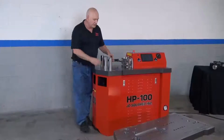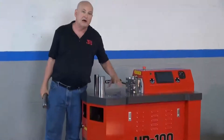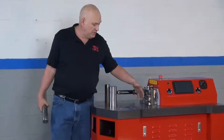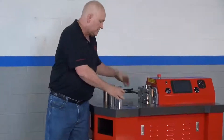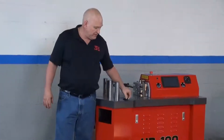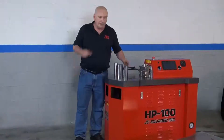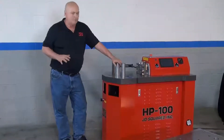If you notice this machine — let me remove this pin so you can see it better — there's no slot in this machine. If you've been looking at presses, you'll see some with slots and some without. We've done our homework and determined that the slotless design is the way to go, for two reasons. One is safety: if you don't have slots, you can't get your hands and fingers in while holding something. That's also why we have hole covers — we supply these and they fit right in here. You can't even drop them through the machine, which is nice. They prevent fingers and parts from falling into the machine. With a slot, it's amazing how many times you're working with something small and realize you can't use your machine because of it. This machine doesn't have that problem.